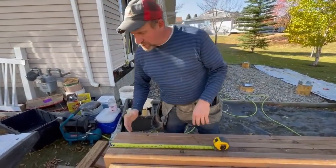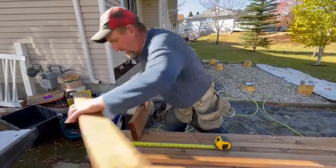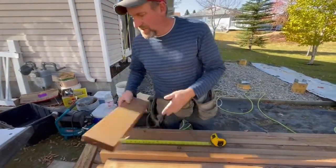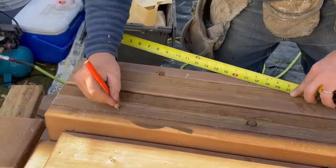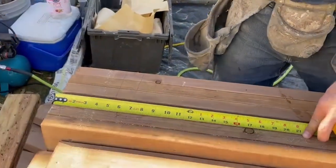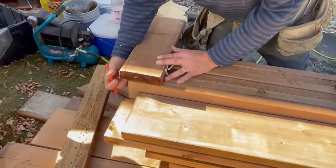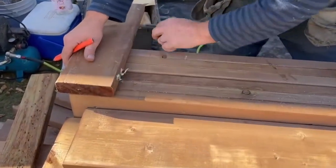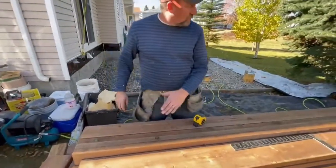Because we're picture framing this deck, we're going to have to have an extra joist — a two-by-six — to catch our deck board coming over here. If we go five inches in and put the X on the line there, that's five inches X ahead. When we put our deck board on, it'll overhang just one inch nicely, covering the edge of our rim. Then our other deck boards can come here and cut nicely, landing on there — all with good support.